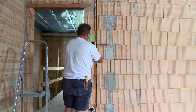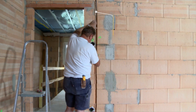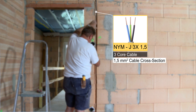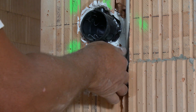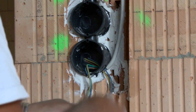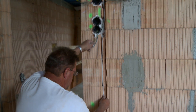The standard cable for domestic installation is the NYM-J 3×1.5 — a three-core cable with a cross section of 1.5 square millimeters each, typical for lamps and sockets. However, stronger consumers such as washing machines or electric cookers need thicker cables. The next cable connects the light switch and socket.